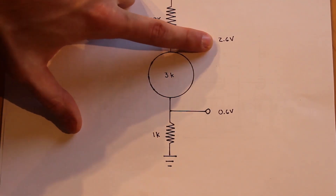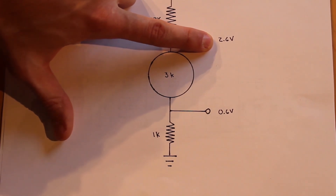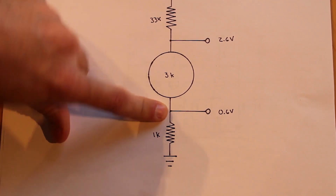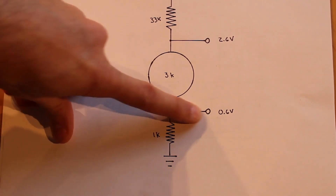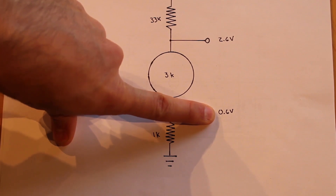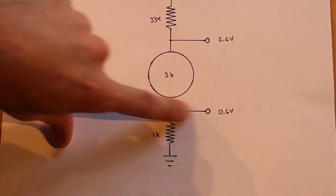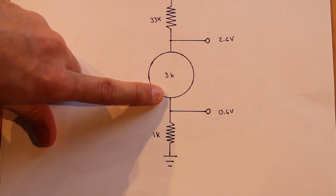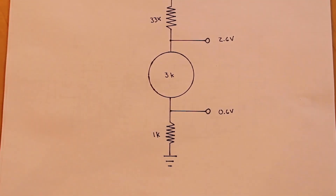on the plate we're getting about 2.6 volts, which is actually a little higher than the 2 volts we were seeing with the cathode connected directly to ground. But if we check the cathode potential itself, that's where the extra 0.6 volts is coming from — we get 0.6 volts on the cathode right there. So the potential of the cathode is slightly elevated above ground.